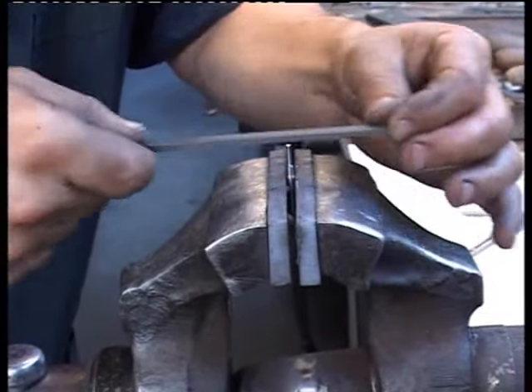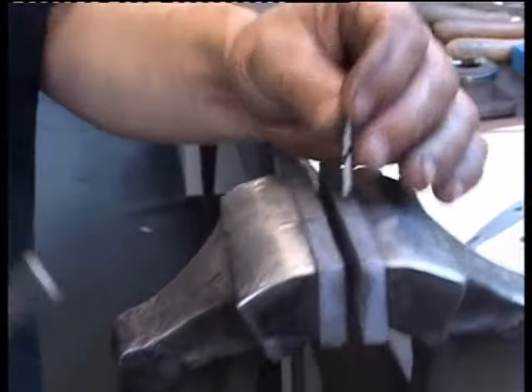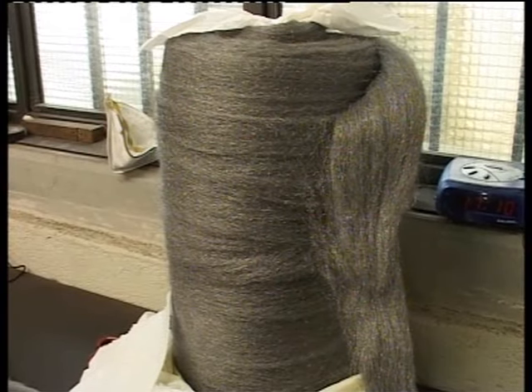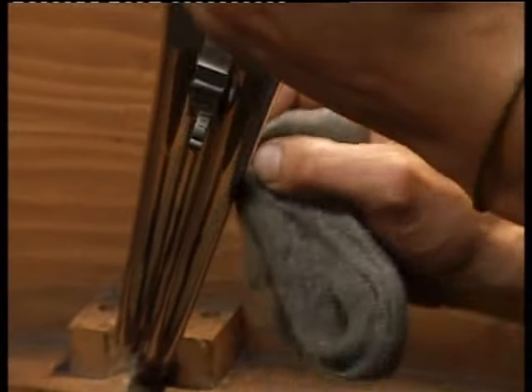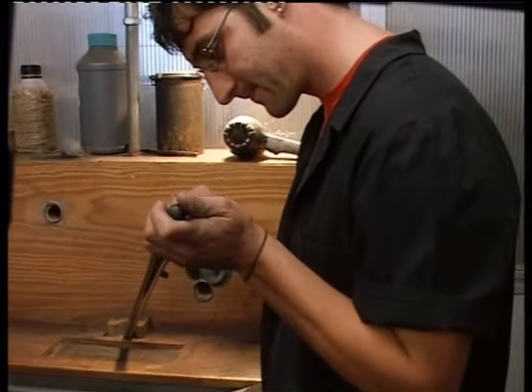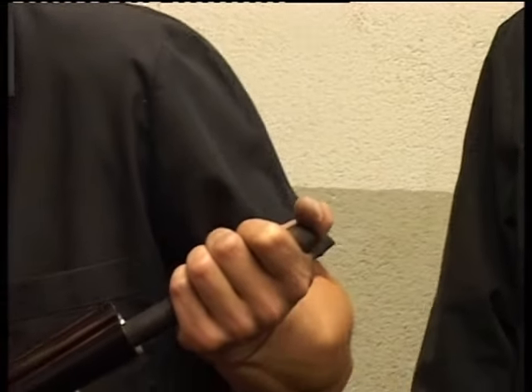Even the smaller parts of the rifle are treated with a cure that we would call maniacal. The bluing of the rifle is executed following recipes that come from a very ancient tradition. We use a system created by the Monarchs in 1700, essentially based on a controlled corrosion of the material. The bluing is not a paint that covers the steel, but an ensemble of small corrosions, small points in the steel that give the blue color with red and violet tones that distinguishes the rifle of high class.